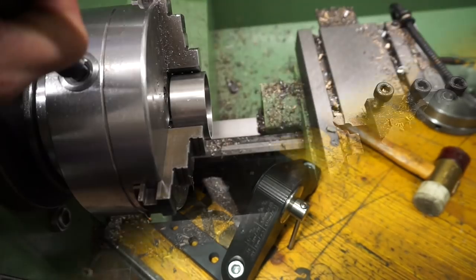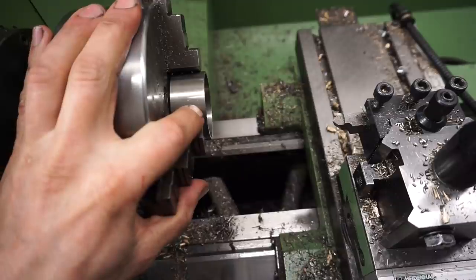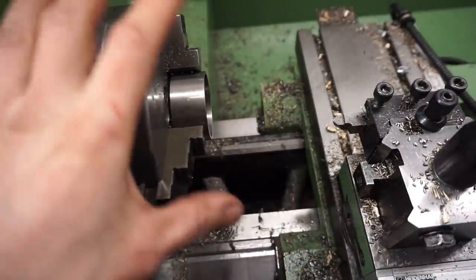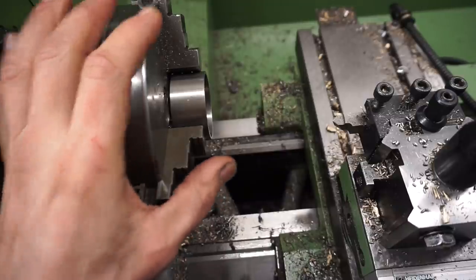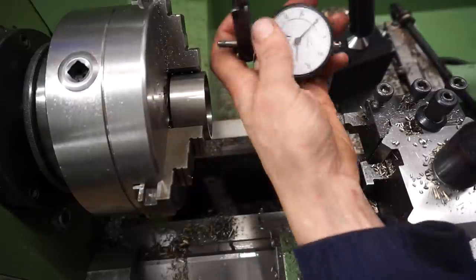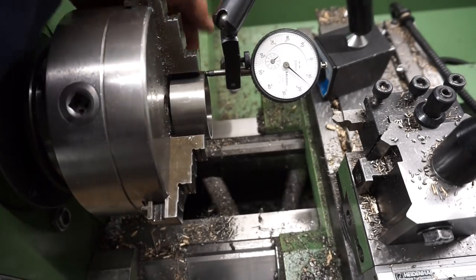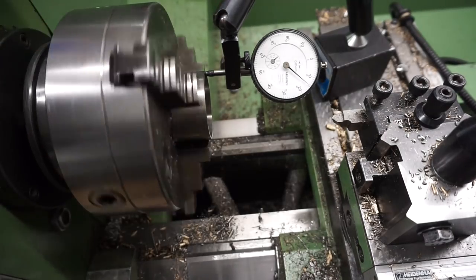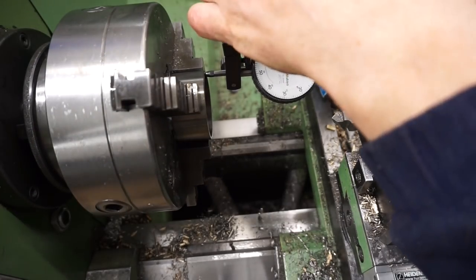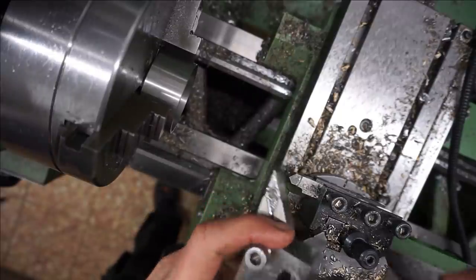Off to the lathe. Before we take off the material from the spacer bushing though, I want to make sure that the axial runout of this bushing in this mediocre clamping setup here is good, so that I do not compromise our measurement from before. So let's see. So that's a few microns, but I can live with that, should be fine. Okay, good to go. Surface grinding the bushing would be more elegant, but the 770 microns are a lot to grind away. So the lathe it is.